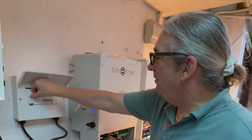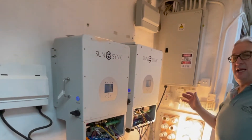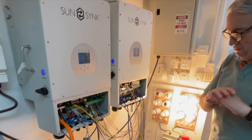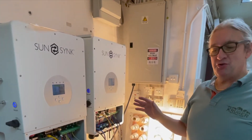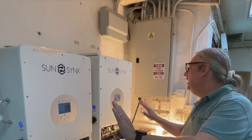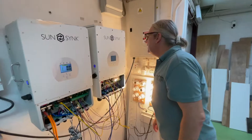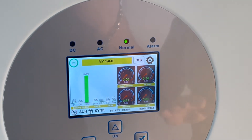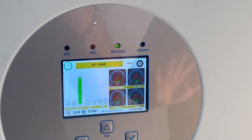Let's turn off the AC and go to battery. We flick the AC off and we're now instantaneously, fully synchronized — nothing happens to the motor. Perfect. We're now running on battery, two inverters working in parallel. They're both delivering 490 watts each — so 490 watts on each unit.